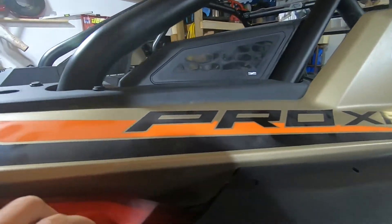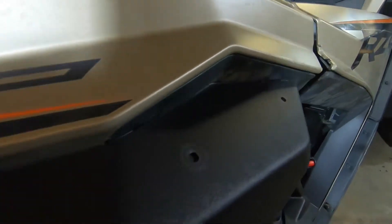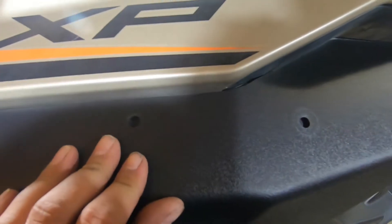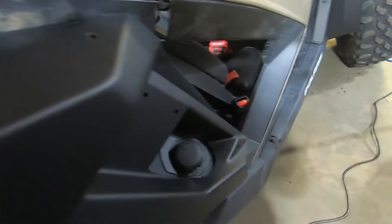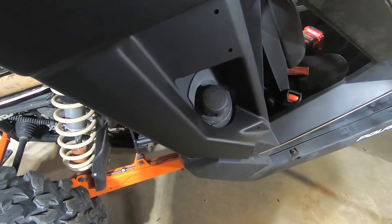Now that we got those three in, we're going to move to the top. It's pretty tight up against here even before I put the rivets in, but as I drill these holes I'm going to be putting a little bit of pressure there. As you can see there's a gap here — you push it so you need to make sure that this is nice and tight when you drill these holes so that they line up perfectly, or the best way they can. Alright, I'm going to drill these holes and we'll show you the end product.